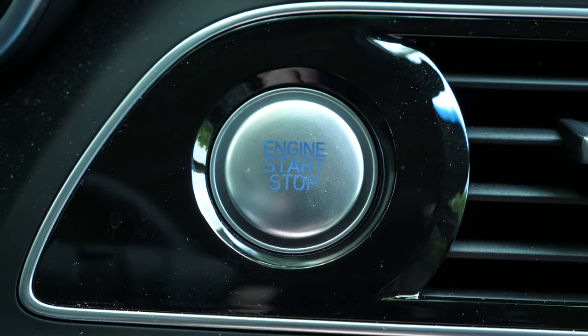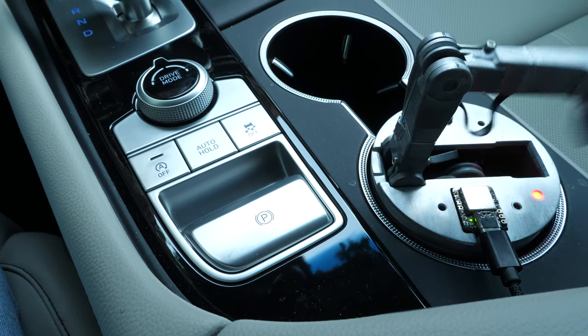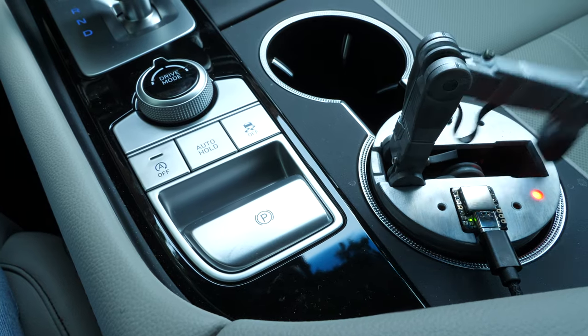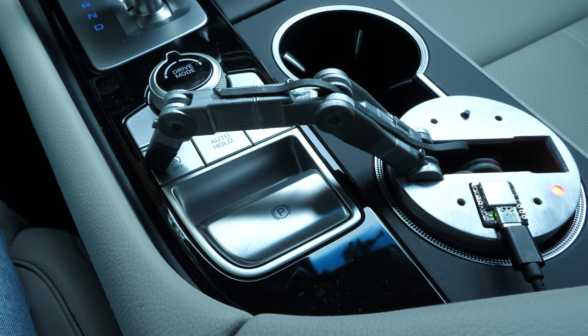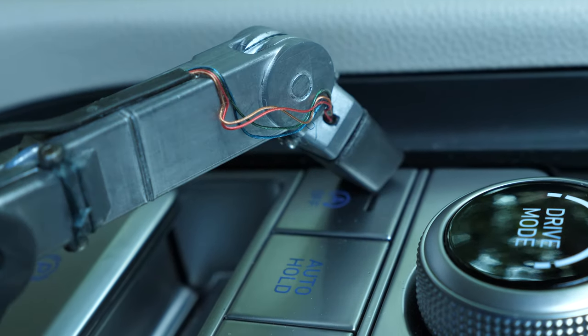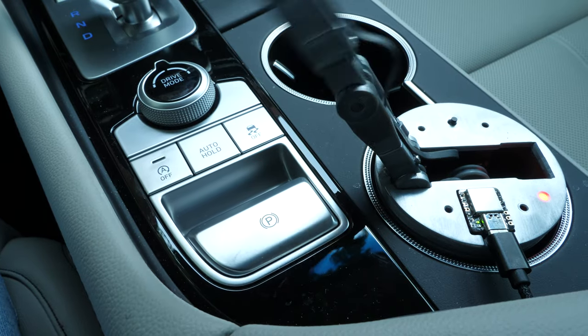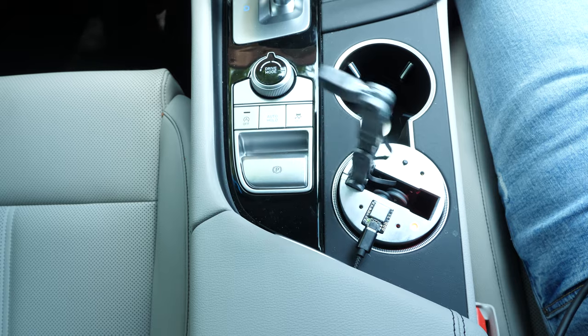Let's see if it works. Turn on the car. It's blinking — green, yellow, orange, red. It's trying. I tried having it just gently push the button in, but it couldn't do it that way. So now I'm having it just whack it to see if it can do it. It's programmed to try ten times to see if it can turn that light. It just can't do it. So at this point, I guess I do have to call this project a fail. Declan was right and the servo is not strong enough to push the button in. I thought it would be because it doesn't take hardly any force to push that button in. But for now, I will have to push the button myself.